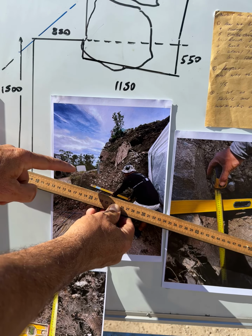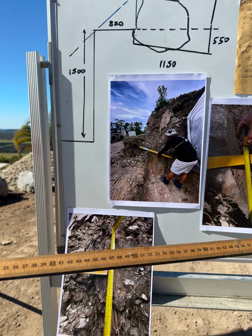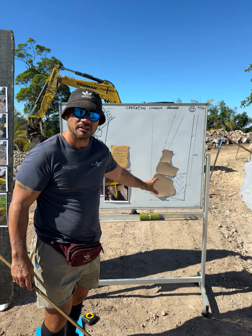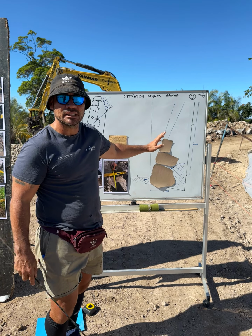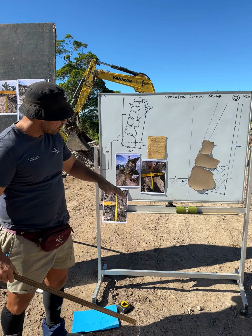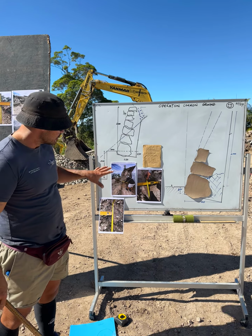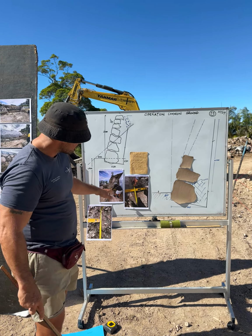Okay, that's natural ground, there's 350. Admittedly, there'll be rocks here and there that are a little bit shallower, but 9 times out of 10, that's because they've been pivoted on their main axis to get this 1 in 4 rake. Okay, so that's why that happens. However, if we have a look at this plane and we project that through and through, we've, by any stretch of the imagination, covered ourselves with the required embedment. Okay, and here it is in black and white.